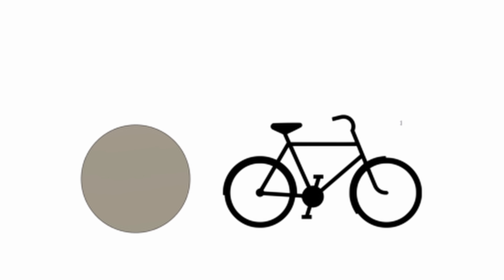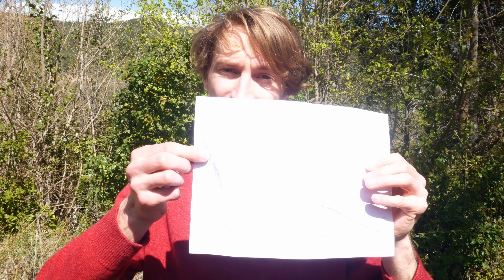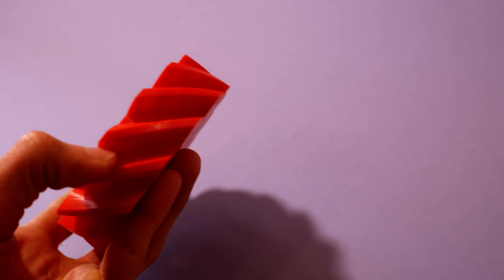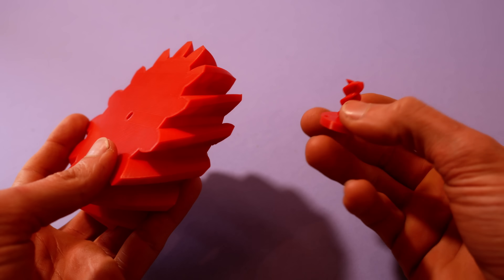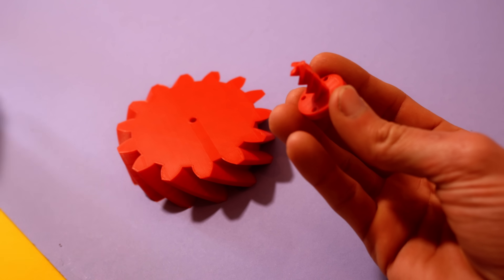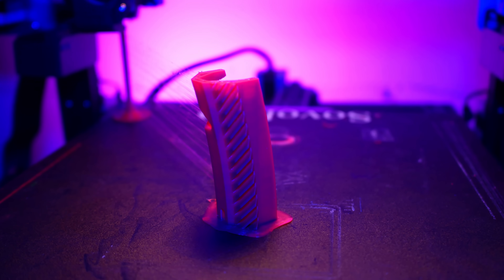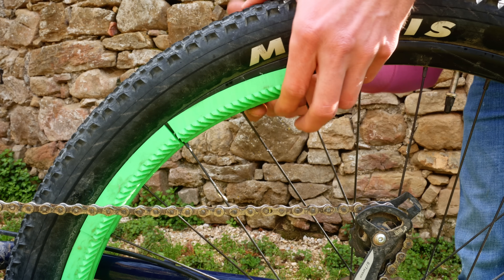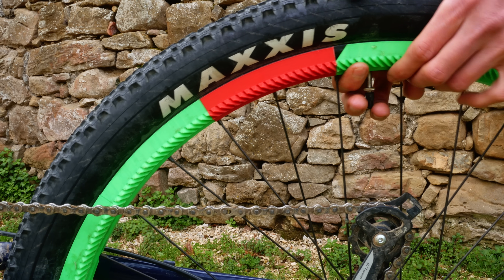The output gear is technically a bit too big for the bike, but I can solve that by time-traveling into the future, grabbing one of my dyno sheets, and showing you that one of these tiny motors has a peak torque of no more than 0.25 Nm. That means this tooth profile is way too strong, even made out of plastic. By reducing to a more reasonable module, we can now fit around 300 teeth on something the size of a bike wheel — which allows an incredibly elegant solution where the wheel does double duty as both the wheel and the gear, reducing parts and making the kit super easy to install.